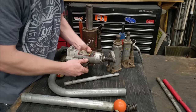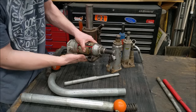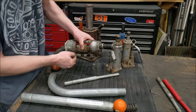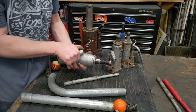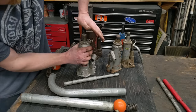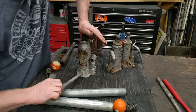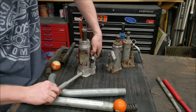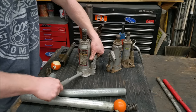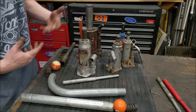So let's put some air in this jack. If you ever want to use a jack sideways you can, but you have to keep this pickup point down so it can draw from the reservoir. If I turn it upside down, I'm going to get air in it — and you can see it moving just a little bit. It's easy to get air out. Just release and pump a couple of times — it's cycling the fluid and air out. Turn it back and the air is out of the system, completely bled out.